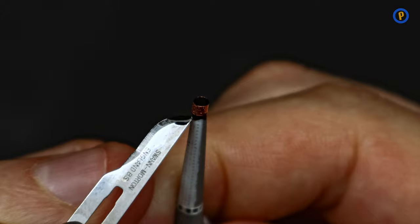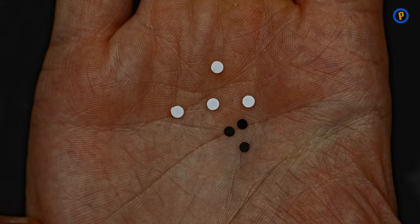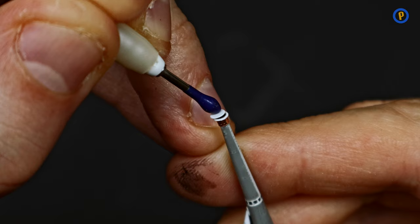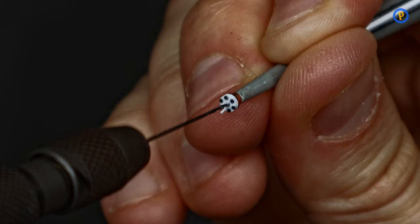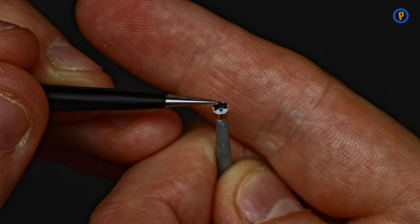To create the lip the gearbox assembly is bolted onto, I used styrene discs. The black one had a smaller diameter and was sandwiched between the outer discs to prevent them from melting together. After adding the bolt head, a piece of electric guitar string was inserted to reinforce the joint which the entire gearbox and rotor assembly was going to sit on.